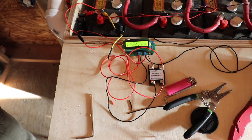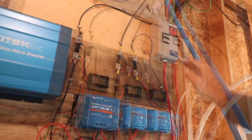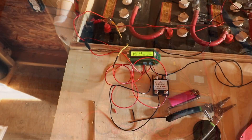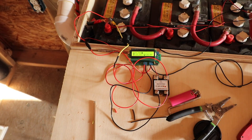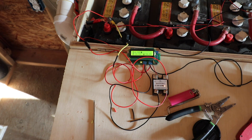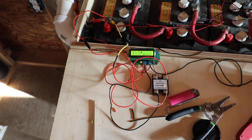Okay, it's off — that's good. Let's flip the solar on, and then we should see our voltage jump. Okay, solar's on. As the voltage rises, when it hits 26 the fan should come on. Yay! Alright, let's turn the solar off and see if it comes off. Oh wait, we dropped — okay, there we go. Yeah, it works! So basically if we're in float the fan comes on. I don't know if there's enough gassing to warrant it being on in float, but I'll leave it set like this for a while and then I can always adjust it later.